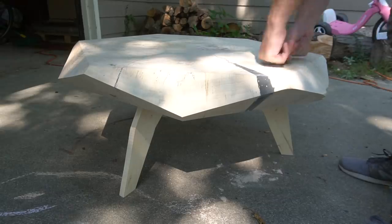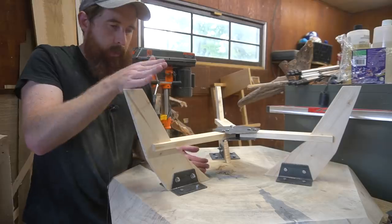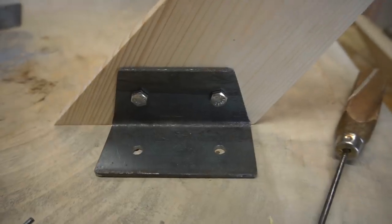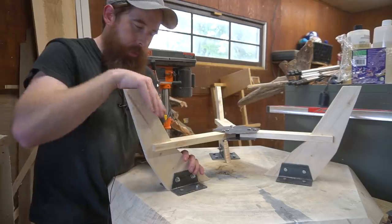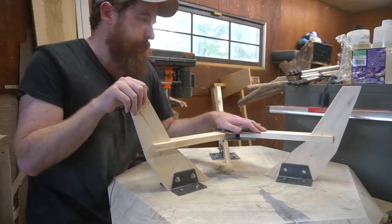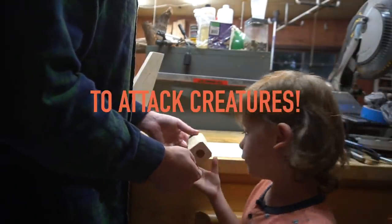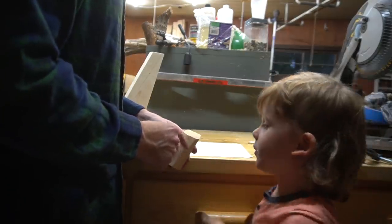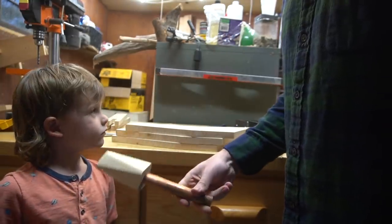What I'm most worried about structurally is that when I put a force straight down on this leg it wants to rotate and these screws want to rip out. Because this wood is so soft, I want to do something about that. I designed this piece so that once I tie it in, it's holding the leg back from tipping — I think it'll make for a stronger table and give me peace of mind. What do you want me to make? A club. A club? To have a nail sticking out of the top. There's no nail in it but that's too dangerous.